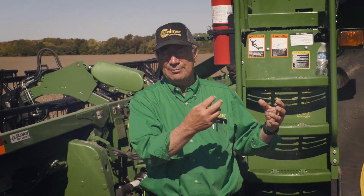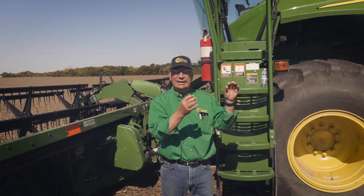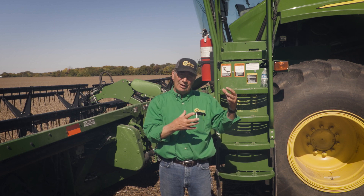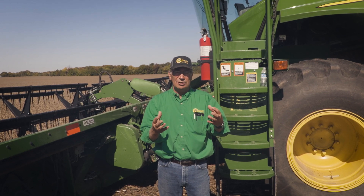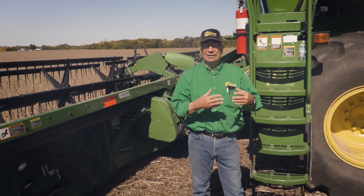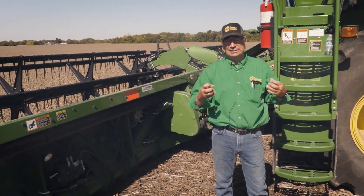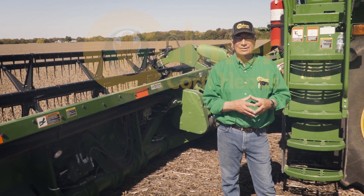For soybeans, wheat, and oats I like 12 inches of steel cover plate. With this combine with round bar, you can snap in the filler plates that fill in the air gaps between the round bars, and that will help increase threshing power which gets those pods rubbed out. Then we can run that bottom sieve a lot further open and decrease the amount of tailings, which decreases the amount of clean yellow soybeans going around for a second pass.